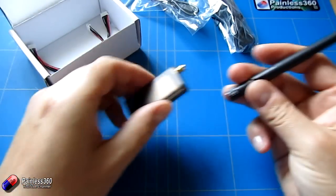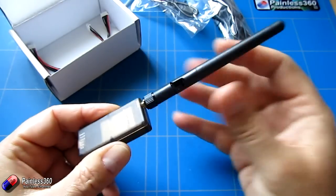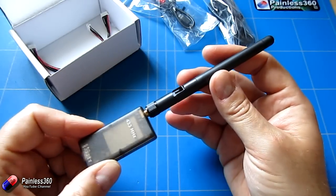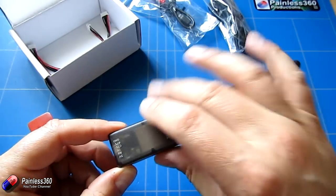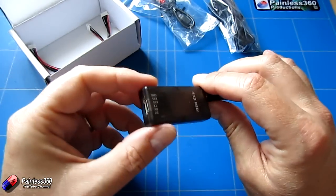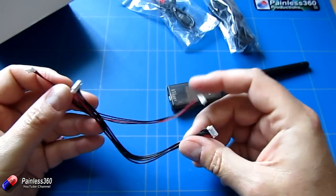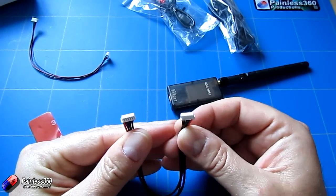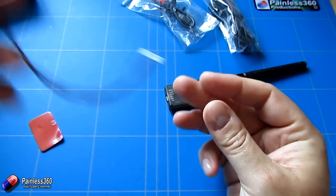We get two aerials. Be careful not to mix these up with the aerials you're using for your FPV or other bits and pieces because these will be specifically designed for the frequency of the radio that it connects to. The way to set this up is to have them both pointing directly upright to give you the best possible signal. You'll notice there's also another connector on the bottom alongside the USB one and that is to connect to the flight controller. These also work with standard flight controllers like the Pixhawk and also the APM.